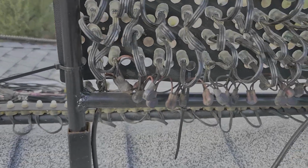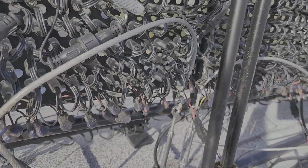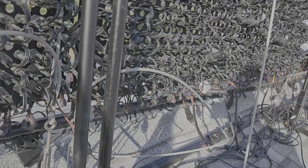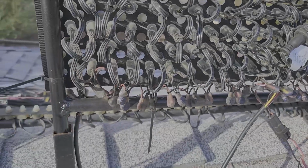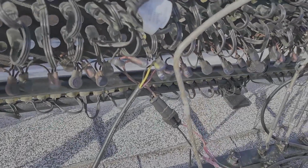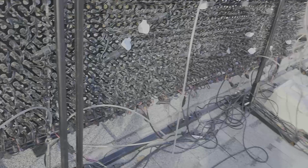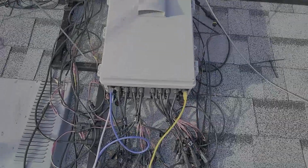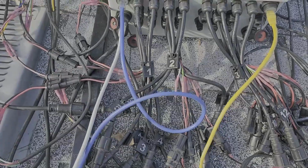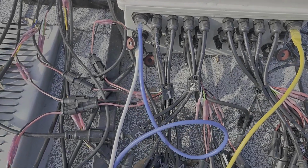So you'll notice across the bottom what I have done is I've interconnected the positive and negative across the entire bottom of the matrix. This allows for easy, even distribution of power, along with cutting the data. So this is running off of 8 ports. I do run in 1 power injection line, only 1 needed for each and every input. Then over here, it all comes back to my K8. You'll notice right here out front though, I have these labeled 1, 2, 3. What this is indicating, you'll see in a second, is which power supply all of these are connected to.